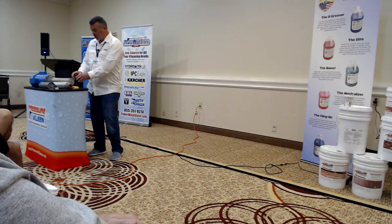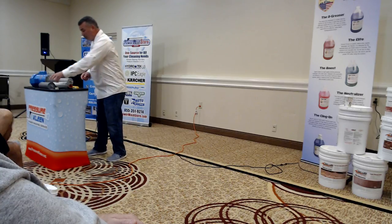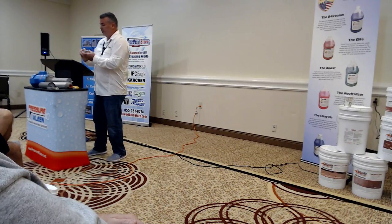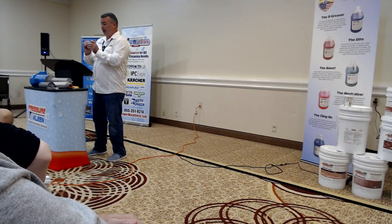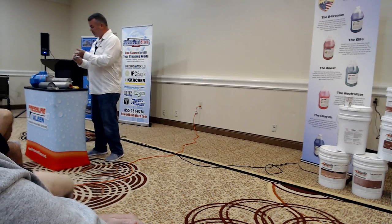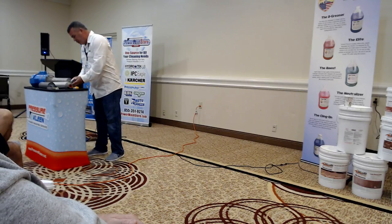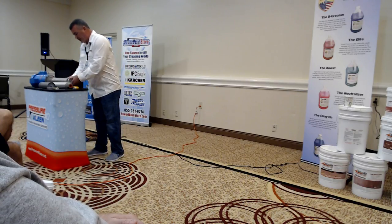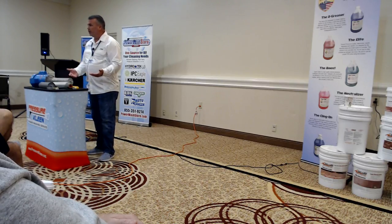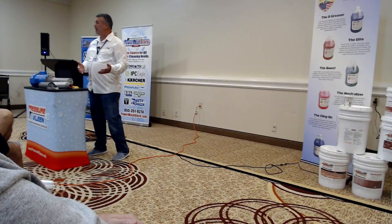So as you start to repair, I'm going to repair this. Okay, there's not one here. And I pull, there is one here. So I have a shim there. And if you're not careful, it's gone, it rolls off. If it's got moisture in it like this one does, it'll hold to it. So there'll be shims periodically placed through here. Usually on a three-quarter horse there's probably 10 or 12, and there could be as many as 15 or 16 on a one horse because we have more stages.